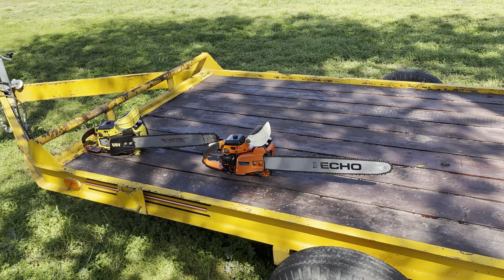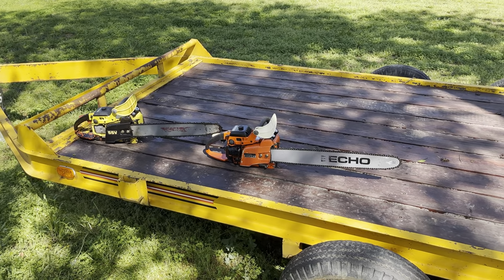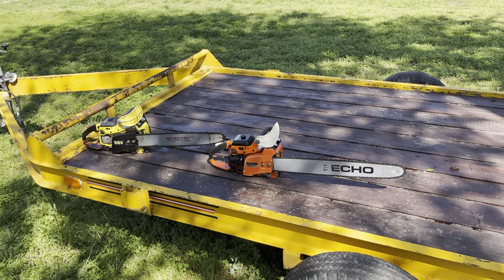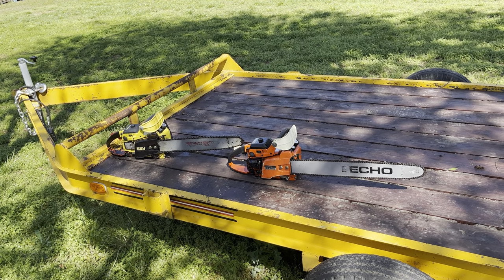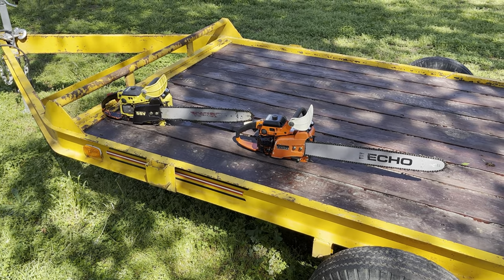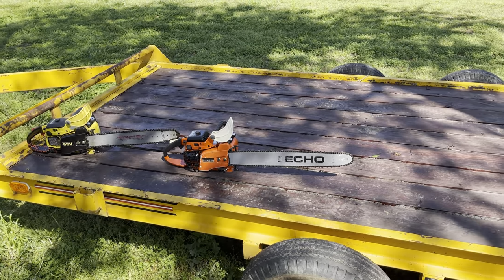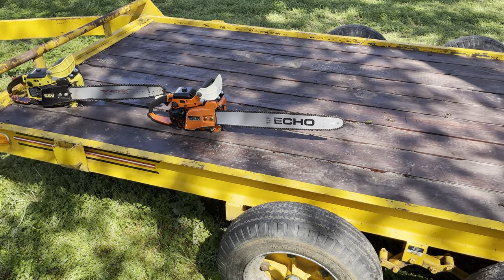And also, guys, by the way, if you want to see how these old saws perform with a 24, go on my channel and you'll see a video, or just type in John Deere 55V with a 24-inch bar. It was cutting through some very tough white oak. The tree had been dead, I think, for about 2 years, and it was about a 24, 26 inch diameter tree. That saw actually had a 24 with a full comp Oregon LPX chain on it, and it did really well. But I do think that the skip tooth is much better for these saws.